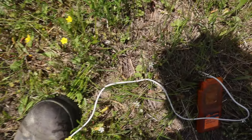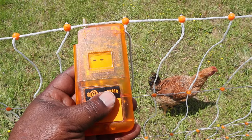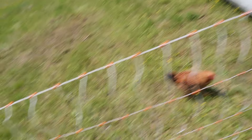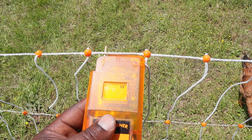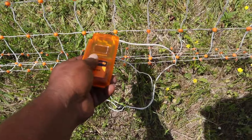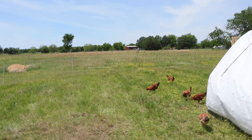This is our Gallagher voltmeter. You take this small ground rod, stick it into the ground, and then you put the reader on the fence to get your reading. This is the S10 that's powering this up. We got 2.3 to 2.6 — not too bad seeing that we had overcast yesterday. I think we could get better than that, so let's go check the volt reading over there.